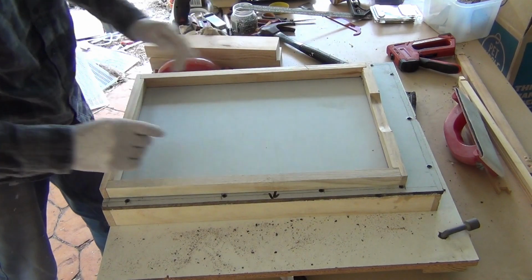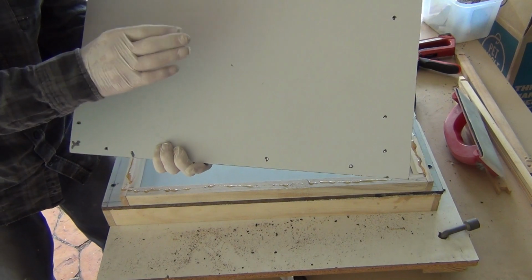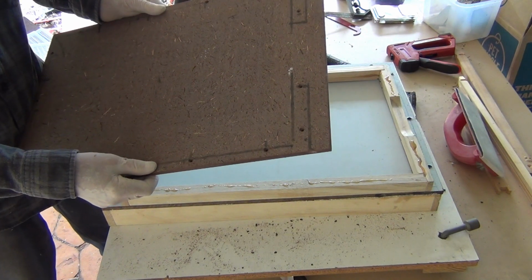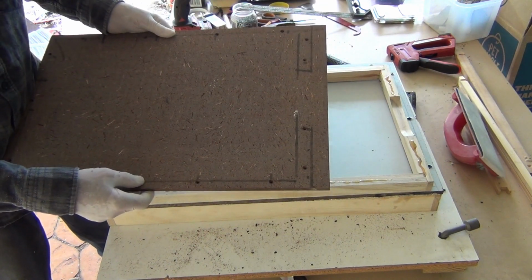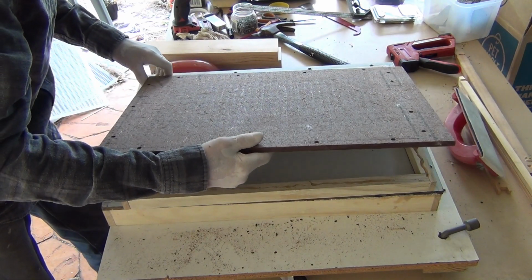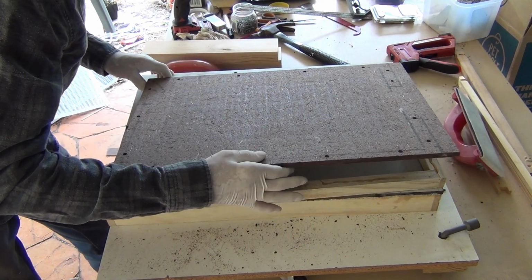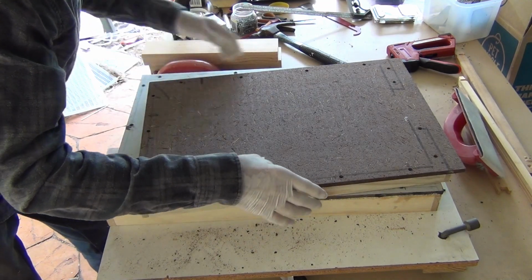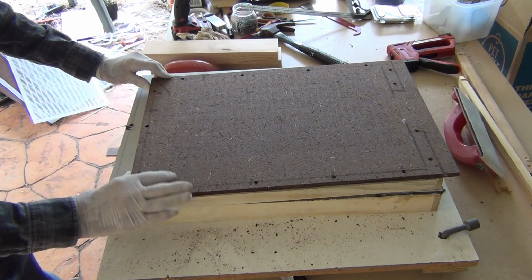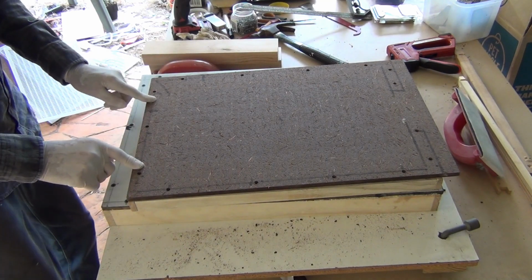Glue up around the edges. Place your board painted side down. The side with the countersunk holes facing upwards. Line it up to the frame edge, in your square corner and along the back. Put 2 screws in.